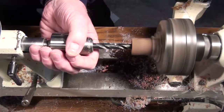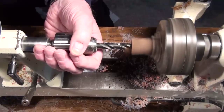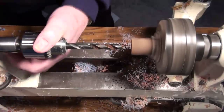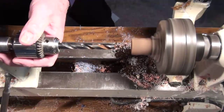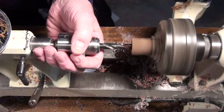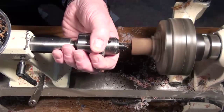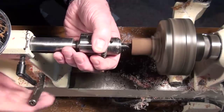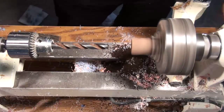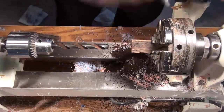It's going to take a little while and you're going to see a lot of repetitive stuff. Let's start out with the drilling section. I am currently drilling the blank and it goes pretty smoothly, but what you can notice is that the drill is bringing out little tiny bits of sawdust. Whenever you get that, you know that the wood is very dry, so it's not going to be a lot of fun. There are lots of things that can go wrong when the wood is exceptionally dry, but we continue and get the blank drilled.